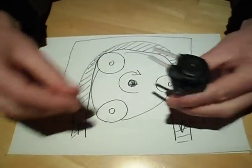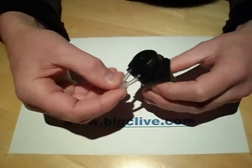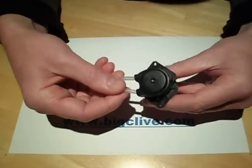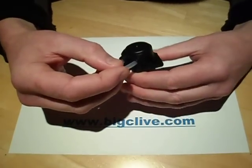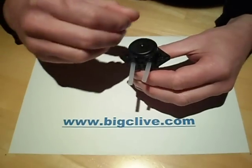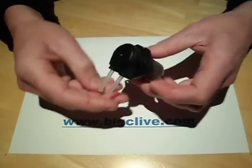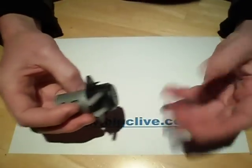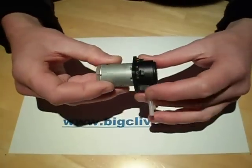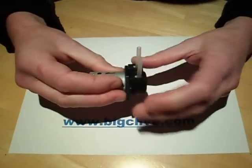There are a few advantages to peristaltic pumps over ordinary pumps. The first is that the fluid being pumped does not get contaminated in any way, like it would with an impeller-driven pump, because the fluid never leaves the pipe — it's pumped in situ. The other advantage is that it's very accurate because it pinches very tightly, so if you run it for a certain length of time it pumps a very precise amount of liquid. This is why they're used as dosing pumps in medicine, the laundry industry, dishwashing, and fish tank dosing.